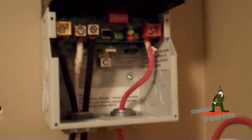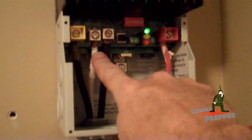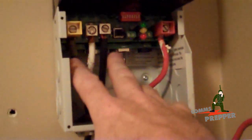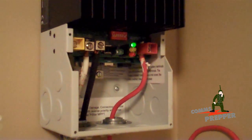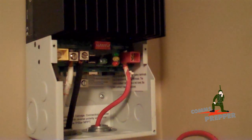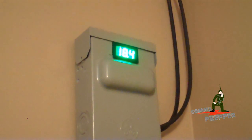For the installation, we mounted it on the wall. The first thing we did was connect the battery ground (negative), then battery positive, which powered the unit up. Then we brought in the PV array — the negative and positive on these posts. The blinking green light, one second on and one second off, indicates the charge controller is in float mode, putting out 13.2 volts to the battery bank — that's the float level for the Trojan T105RE battery. Above that I have a disconnect box coming down from the solar panel array, and the array is putting out 18.4 volts. So we are now operational.